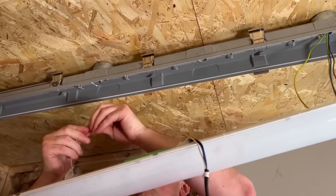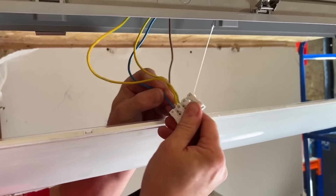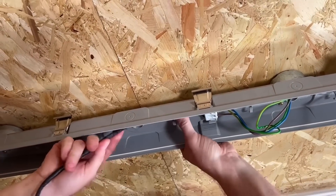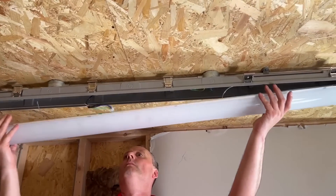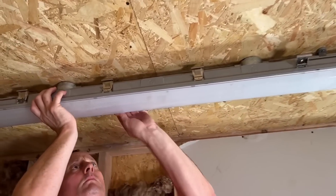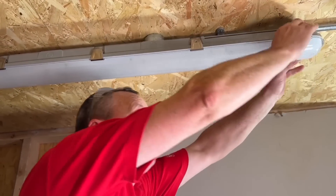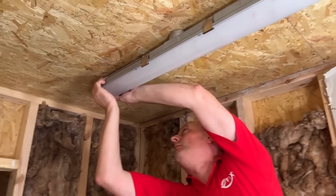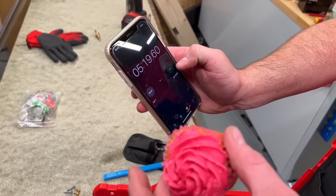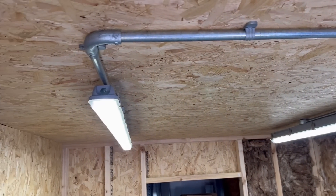In go my tray clips. And again, we're seeing another key difference - the fitting, the tray and the lid are actually all combined into one thing. Connections are super easy - I've got one of four positions I could have clipped this into, and the cable reaches all four of those. Just ready now to position my tray into place, making sure everything's tucked in. That combined tray and lid just go together and those clips snap into place - they weren't in your way at all. Just two more to go, and that felt a lot quicker than the previous one. Wow, that was fast! I don't think I've left smug mode - but the real star of that was this light fitting from JCC.